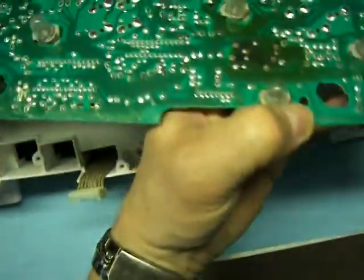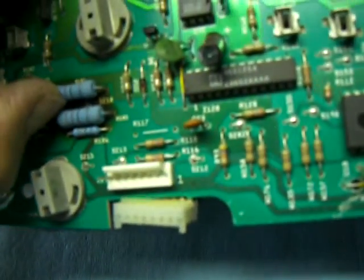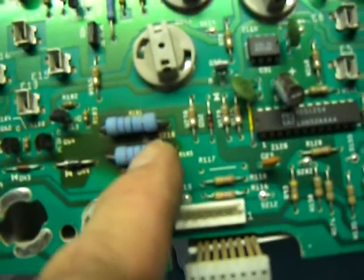There's the back side of our problem area. Right there you can see how it's all darkened. We're going to throw some extra solder on those spots. Right in here between these two resistors there's a joint that needs to be soldered. So we're going to try to kind of move these resistors out of the way a little bit, just like that. And we'll be able to get in there with our soldering iron, right in there, and solder that up.